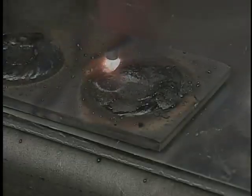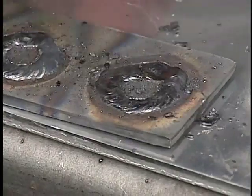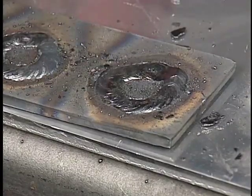When you first strike an arc, pull back about two electrode diameters to help stabilize the arc, preheat the base metal, and start the puddle. As the puddle starts to form, reduce the arc length to about one electrode diameter. Move slowly in a circle to form a button. The puddle is a liquid form of the weld bead, so concentrate on what's happening in the puddle and keep the electrode on the leading edge. Then break the arc with a quick twist of the wrist. Remove the slag with your chipping hammer and ask your instructor to critique your welds.